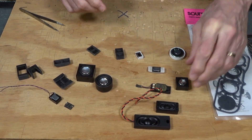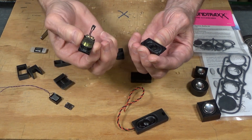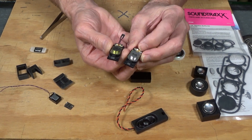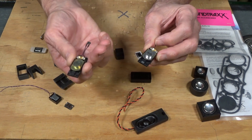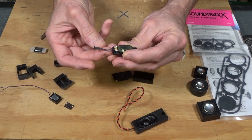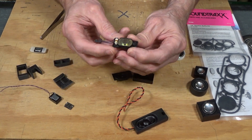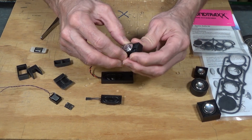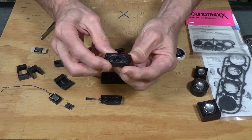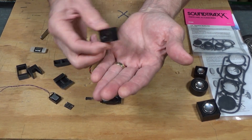These enclosures are available from TCS to go with WowSound decoders in particular, but decoders in general. Another very popular type are these oval-shaped speakers. These are basically 8-ohm, 1-watt speakers, and they have two solder dots on the back for attaching the wires. One reason these have been so popular is that they are narrow enough to fit in the hood of most diesel units, so they're great for that.